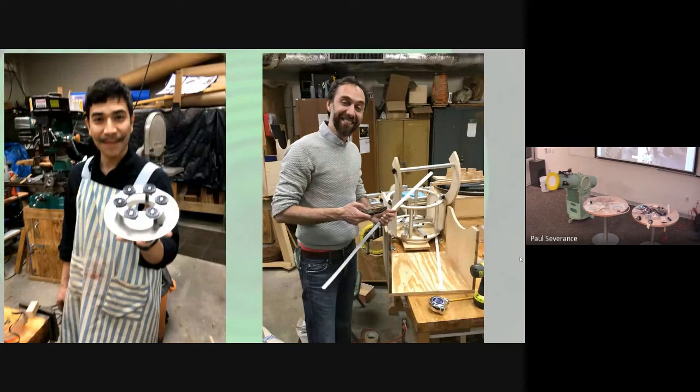And this is for a 6-inch f/2.88 telescope. You'll see some pictures of it in a little bit. Almost f/3, really, really short. And he was saying that you have to collimate just so. If it's not collimated properly, then all the stars are blurred. But if you get it collimated perfectly, and the conditions are right, the wide field views are fantastic.